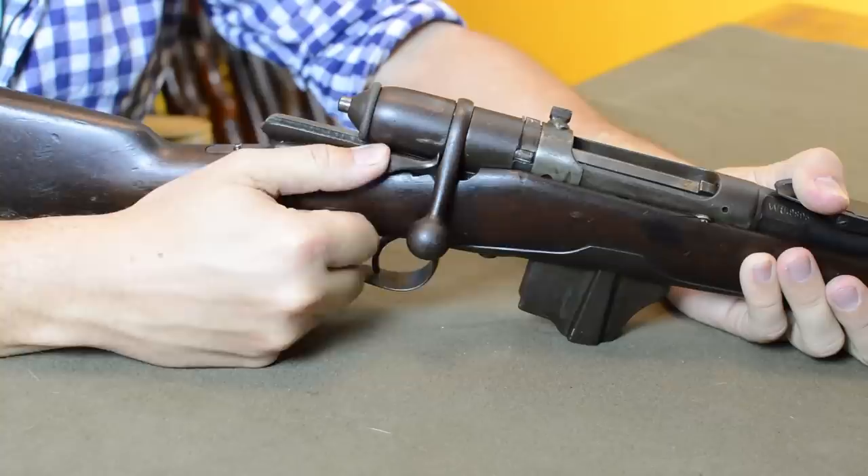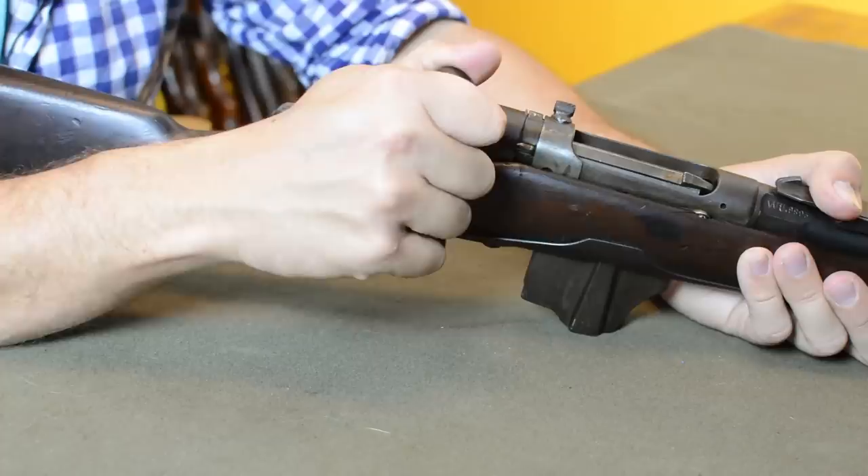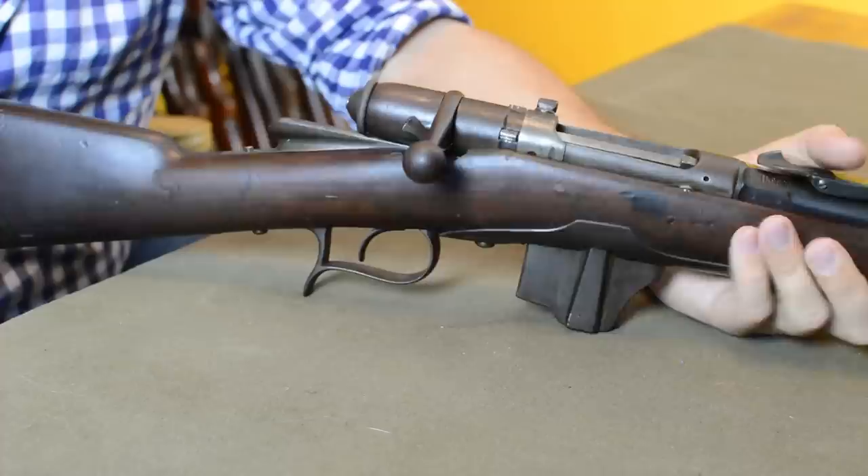That safety needed to go, and it needed to go inexpensively and with minimal adjustment. So in steps Vitale in 1884 with his own unique safety — that safety would stay with the gun for the rest of its service life. Let's get in — you see there's a swoopy-doop right there. I have to open the action, feed a round, imagine it's a single shot, feed a round and then throw the safety and then bolt forward. This is really the only way to sort of set it up. You would bolt forward, and as I bring that bolt in, that swoop holds the root of the bolt handle so that it cannot close all the way. At the same time, when we had pressed this forward, it had actually sort of disengaged the sear — you can see the trigger moving because of it.